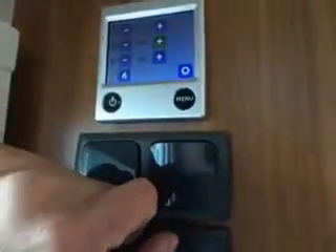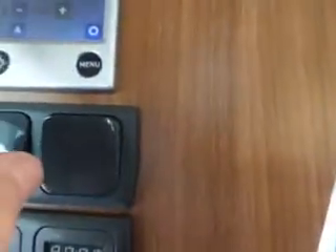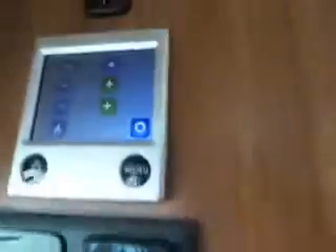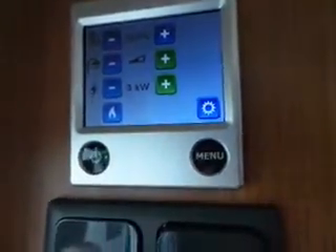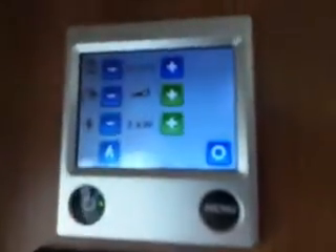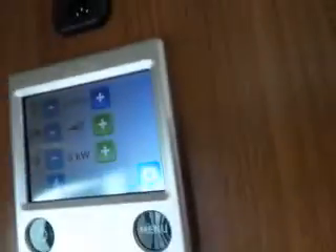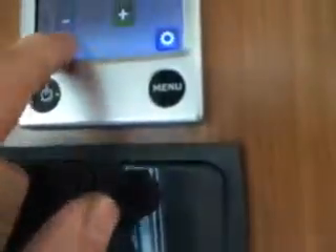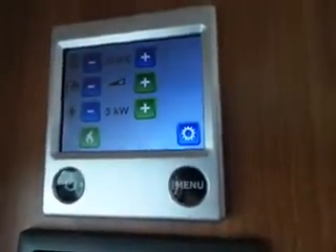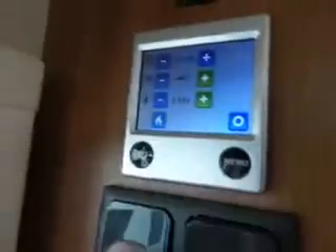Energy — what energy you want to use. So that's electric off. You've got options one, two, or three. Generally if I'm on site I use electric, so I just press that — it's on three kilowatts now. In the summer it should be fine on electric alone. In the winter you may require gas as well. If you use it in the colder months, you've got to remember that unit — it's trying to heat the room and the water at the same time, and in winter it may struggle on just electric alone.